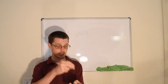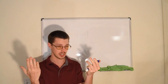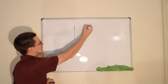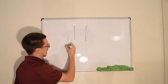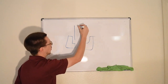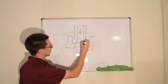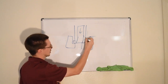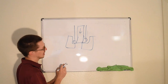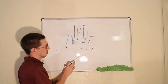A metal wire comes down and presses against the back of a rotating die. The wire heats up, softens, spreads out, and then either contacts the walls of the rotating shaft, or if it is prevented from that, we have a die with a hole in it, and essentially, what ends up happening is our wire here gets shoved down into this rotating die, and at some point it'll contact it, and this causes it to flash, basically. It rolls into this potato chip or flattened bullet shape. It could be any number of things, but regardless of the specifics, it tends to roll into this shape.